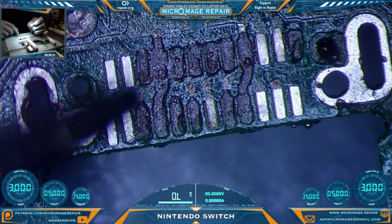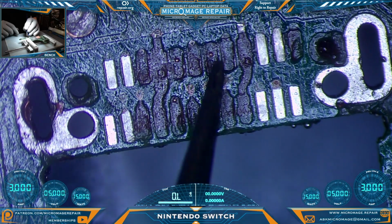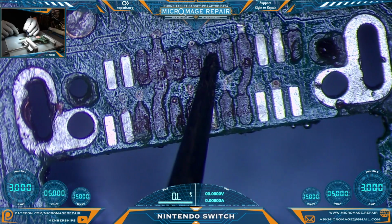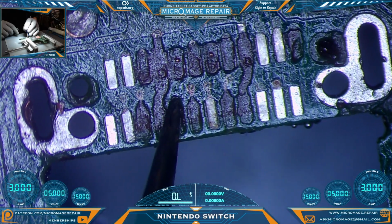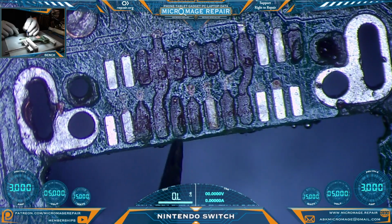Now, straight away we have a few problematic areas. As you can see, all that's left of the pads here are the two vias. We're probably going to have to run long jumpers to these. This one is not so much of a problem because of its location. It's actually located at the top. We can run a jumper from that via and cover the whole pad.